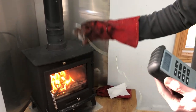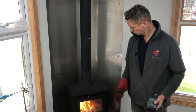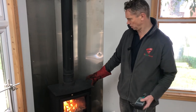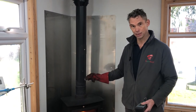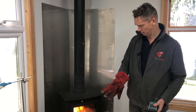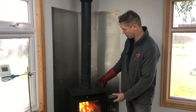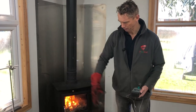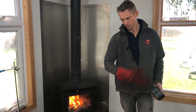At the moment it's still quite a narrow jet, but what the jet is doing is pulling out and drawing the radiant heat with it. So most of the heat displacement is not from the flue air itself — it's the fact that the hot air from the flue draws the radiant heat with it. It draws cold air in, hot air follows, and it will start to oscillate and move wider and wider as the hot and cold air join together.